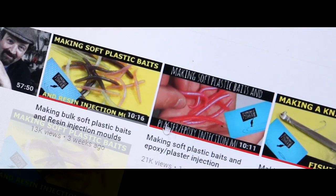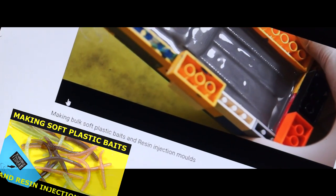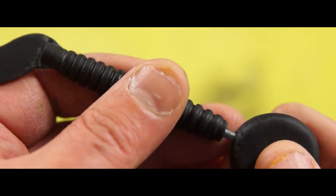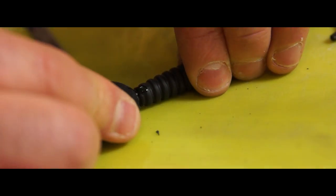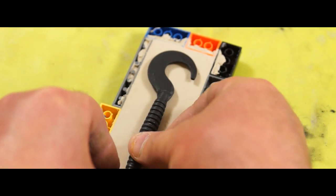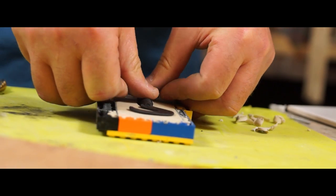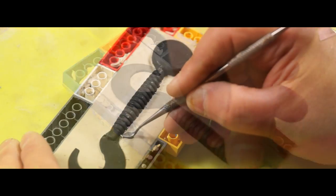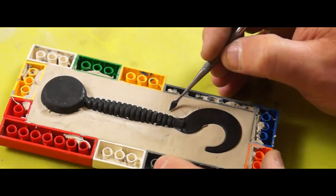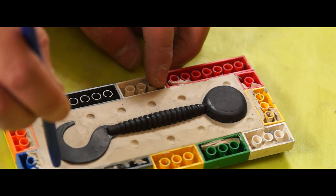Having covered making injection molds for soft plastic baits in recent videos, rather than repeat that I thought I'd give an overview of the process in this video and post links to those videos for people looking for more detail. I started by baking up a thick disc of polymer clay with some of the tent peg shoved in it. Once removed I could fit this to my grub and secure it with super glue. For a mold box I used the kids' Lego again and filled it with ordinary modeling clay before flattening it off. After pushing the grub in a little, I used a clay tool to scrape away some material until I could push the grub in comfortably to the halfway point. Then with another clay sculpting tool I cleaned up and made a neat seam, and to create dimples in the clay to act as keys I used the dome off the end of a paintbrush handle to help locate the mold back together when finished.